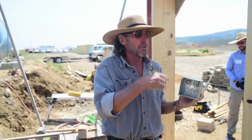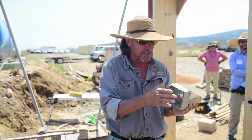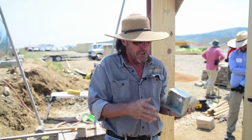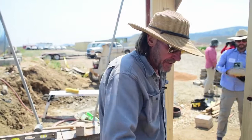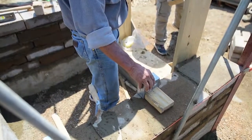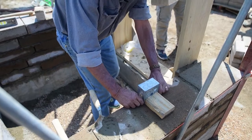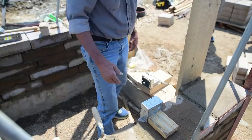Plaster rings come in quarter inch, three-eighths, half inch, five-eighths, three-quarter — maybe to the end of three-quarter, I'm not sure. You can get different thicknesses, and the thickness you want to buy is the one that matches the thickness of the plaster you're going to apply. That eliminates any guesswork for where this block goes — it goes right to the edge of the block.